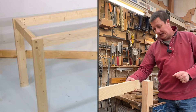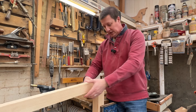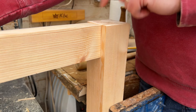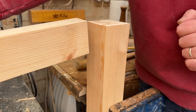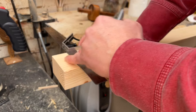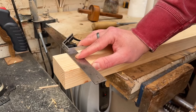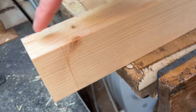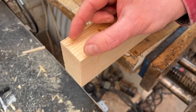But what if you were building a table and you want the rail to attach halfway through the post, nice and flush at the top? For that, we're going to cut out a little tongue or tenon on this piece so that we have a shoulder to go into the post. First, mark off that shoulder — you can make it whatever size you want, usually an inch or an inch and a half will do — and score lines on three sides, not all the way around. We're going to cut this section to be smaller than this section, especially the width of it.